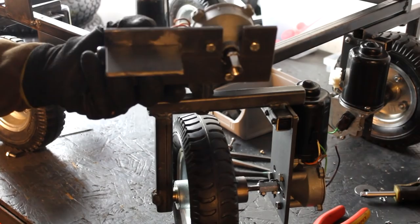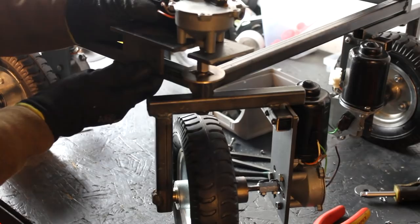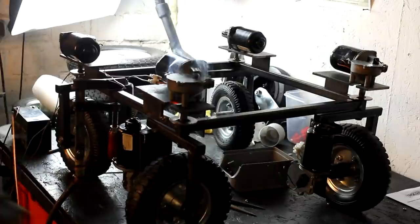And here you can see how another set of four identical windshield wiper motors is now installed onto these axles as steering motors, again using 30 millimeter connector nuts and parts made from 70 millimeter flat steel. And after many hours of aligning and correctly centering all these parts, I then finally weld both ends of the connector nuts to the motor shaft and the steering axle, locking everything in place.